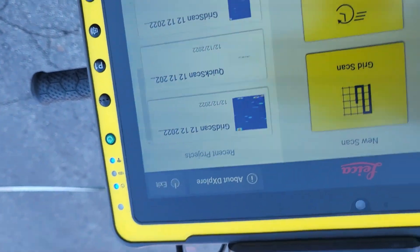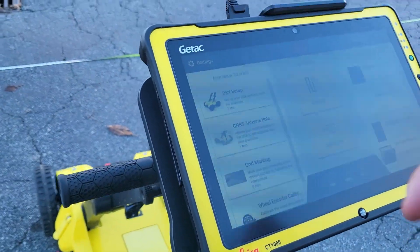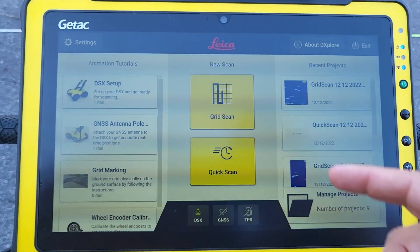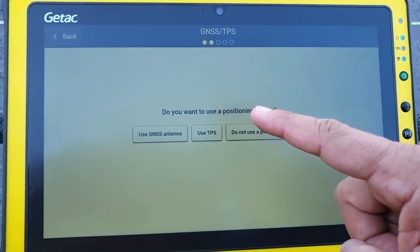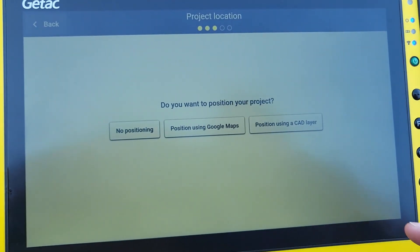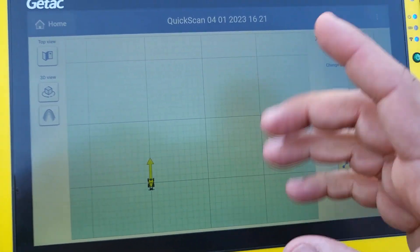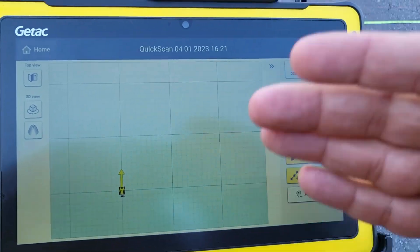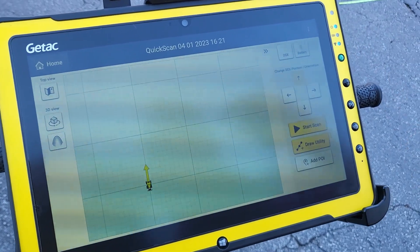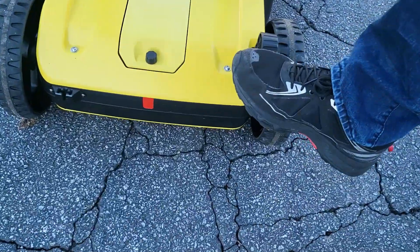If you're going to scan without GPS, you'll need to use a measuring tape. For this tutorial we're going over the quick scan mode using a measuring tape. In quick scan mode it will ask whether you want to use GNSS/GPS or not — we're going to select no positioning device. So we're not using Google Maps; we're saying no positioning at all. Now it's ready and brings us up on a grid. Lay out a tape to use as your guide showing where you are on screen. We'll roll right up on the tape, but first unlock the kickstand — the brake — so we can roll it.